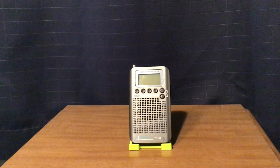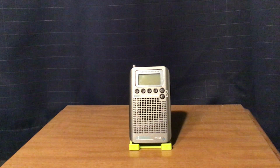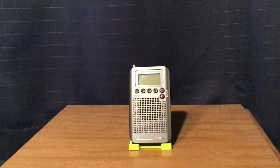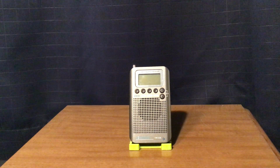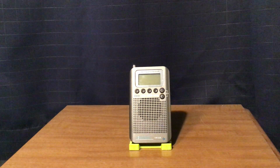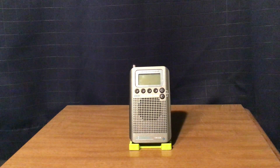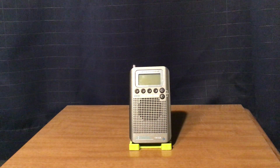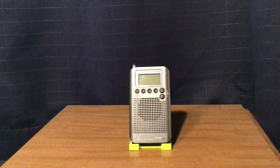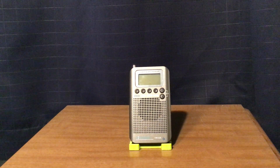The air band can actually be interchangeable in its steps. It's 118 to 130 megahertz with either 5 or 25 kilohertz steps. I kind of wish they did that though for the VHF instead. They're 25 kilohertz steps, which means you may, in certain activity, not get the actual frequency, especially, you know, amateur radio where it's not always in 25 kilohertz steps or other public service activity. By the way, VHF, it says 30 to 223. It actually goes to 230 megahertz and 25 kilohertz steps.